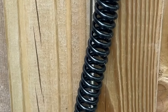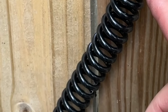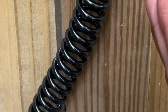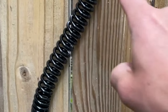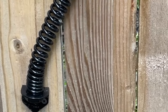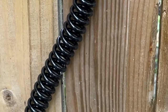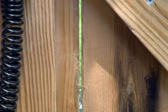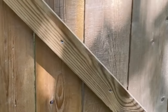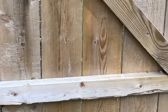To get more closing strength without over-tightening, you can size up. I thought one 16-inch spring would be sufficient, but ultimately I was happier adding a second, smaller one — about 10 or 12 inches — for an extra $10-12. I mounted it at a slightly wider stance, which creates more closing strength. On a still day the top spring alone was fine, but with wind pushing against the heavy gate it just wouldn't close reliably.